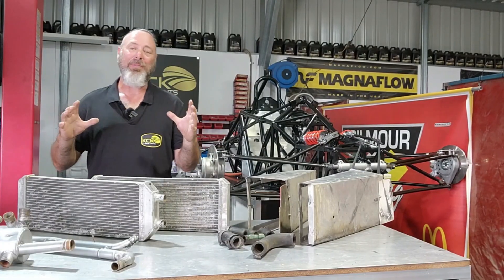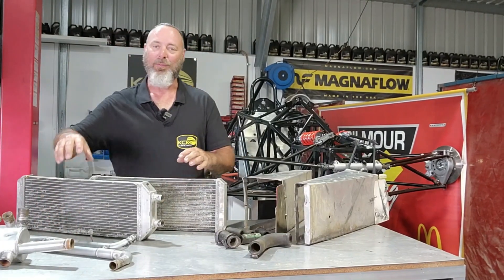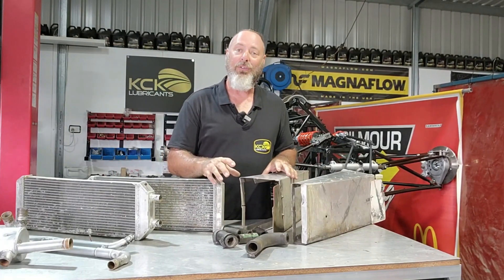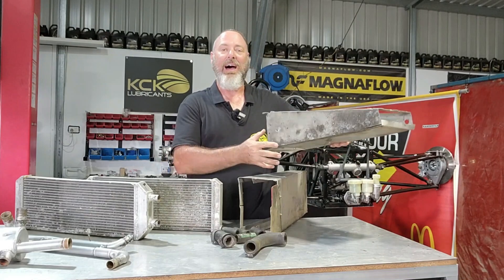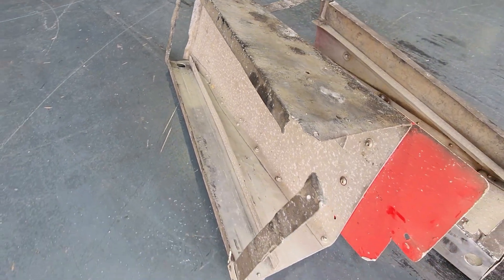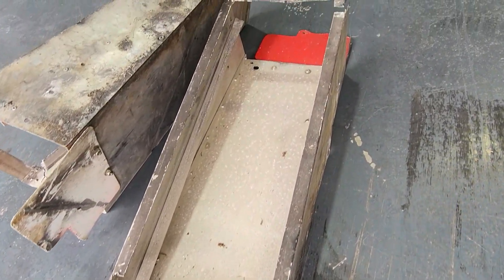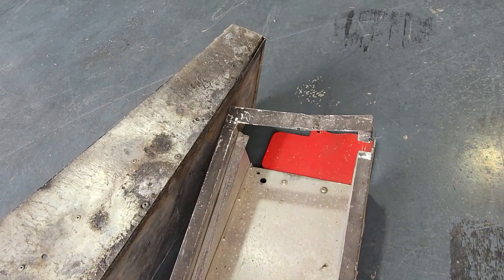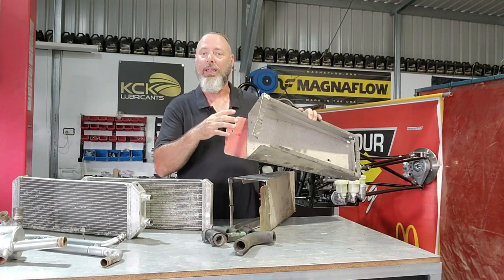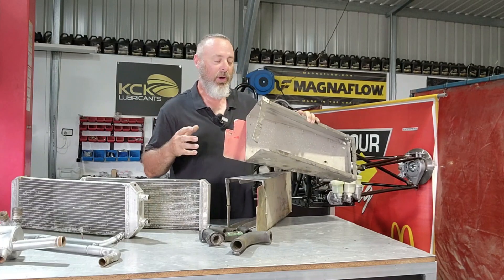This pretty much sums up the entire cooling system of the car. We've got an expansion tank, some crossover pipes, two radiators, some flexible hoses, and these bits that sit in the side pod — the radiators push into these. The radiators aren't solidly mounted because if they were they would break. They float in these boxes to absorb vibration. If these break it's not a big deal, but if the radiator cracks, the coolant falls out — it's the end of the world.